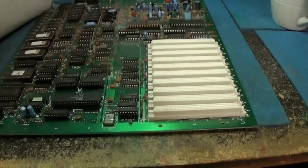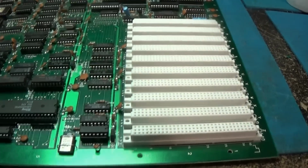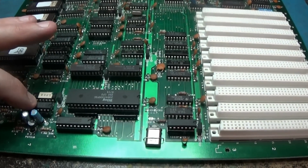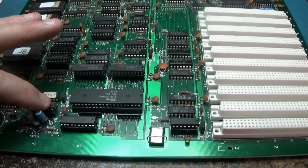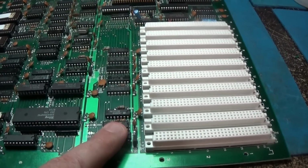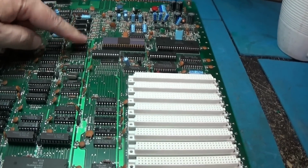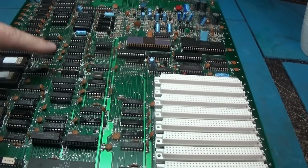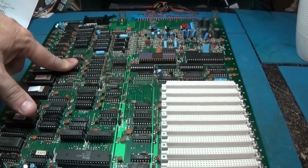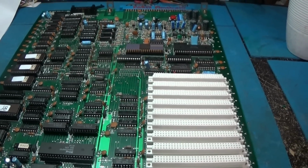Alright, as a bit of maintenance type stuff, those Fujitsu chips, I had the 04 that obviously had a problem internally as far as propagation or whatever. I replaced all of them. There were 4 of them. 1, 2, there was one here, and then there was a couple other Fujitsu parts that I replaced, a 00 here and a 74 here. So I got rid of a lot of those because those Fujitsu parts are always a problem.